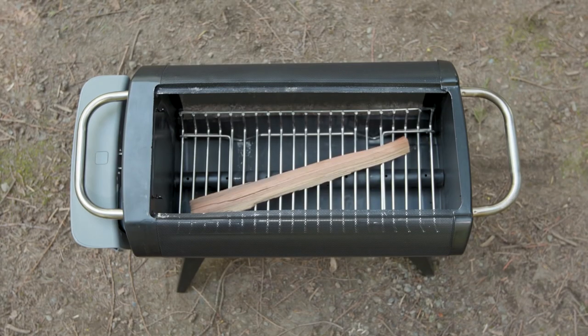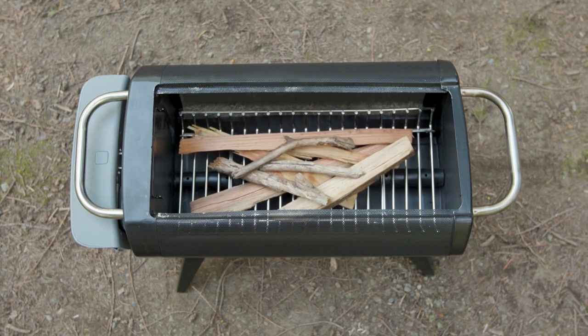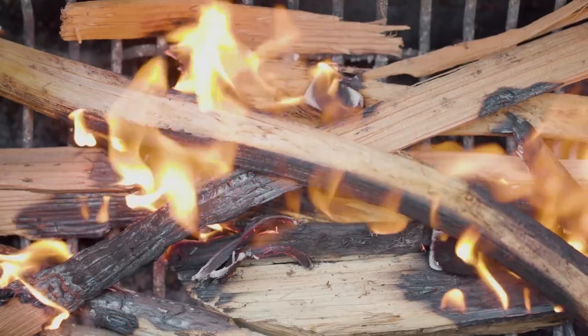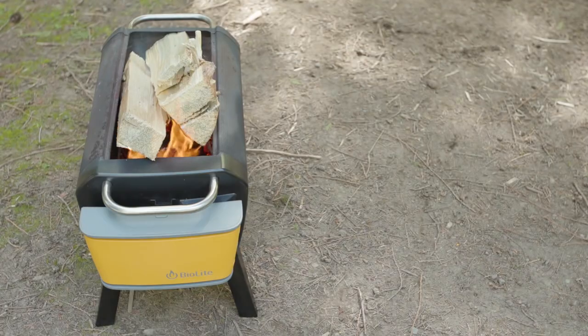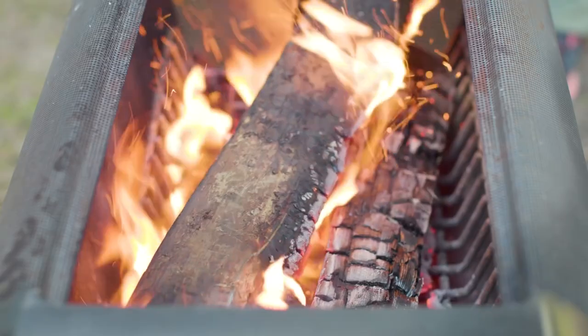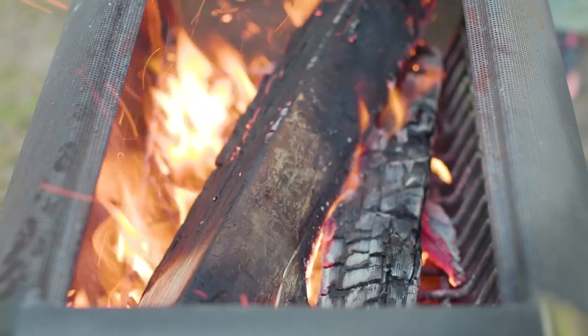Speaking of that great fire, it's got to start small. Just like your classic campfire, you need to build a base coal bed and then work your way up to larger pieces. If you just throw in a big old piece right at the start, you're going to get some smoke. Once you have built that fire up, remember that there are 51 jets in there looking to help you out. Let them do their job. Don't block them by overstuffing the chamber, by extending wood beyond the chamber, or by laying firewood flat against each other. Those jets need space to feed the fire with oxygen.